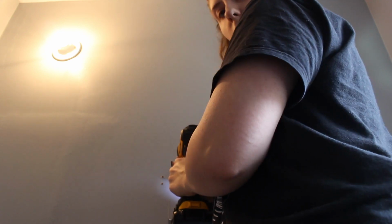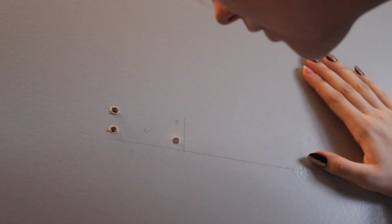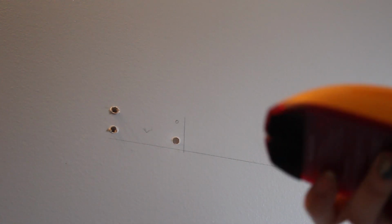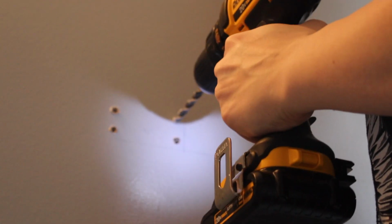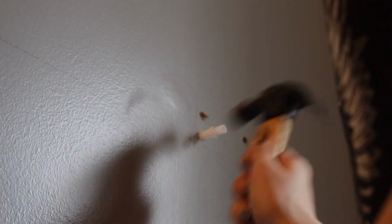Now, they say if you're going to place a shelf above your toilet, you need to place it about 2 feet above the highest point of the toilet tank. That is so, obviously, if you need to clean the tank or replace the water in the tank or repair the toilet in some way or even change the toilet out entirely. If those things need to be done in the future, you don't want to have to remove an entire shelving unit and go about doing basically another renovation in order to just replace one part of your bathroom. So I definitely recommend sticking with that measurement.